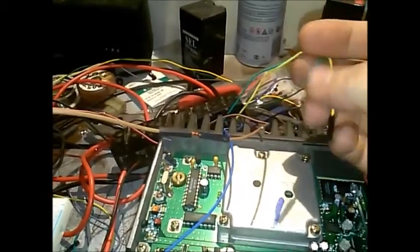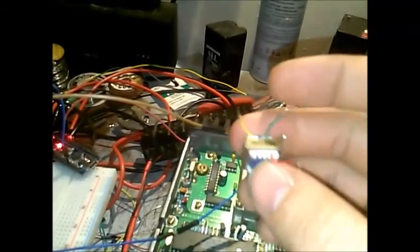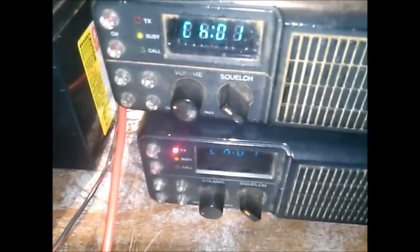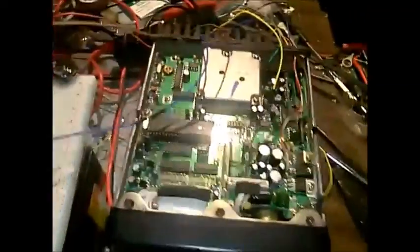The audio — we have a receiver audio and a transmit audio. I'm not hooking those up yet because I still need to put in this little audio isolation transformer to make it right. But you can see clearly that's the same — I've got about a two to three second hang time. Currently the program has no CW ID, no courtesy tones, or any of that. I don't want it in this one — I just want it to be a straight shot, simple, quick, and easy.